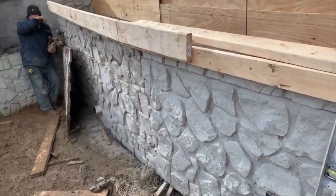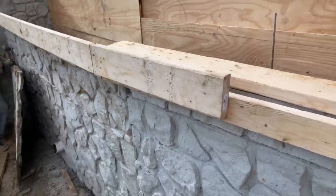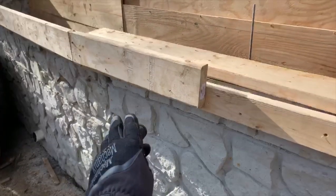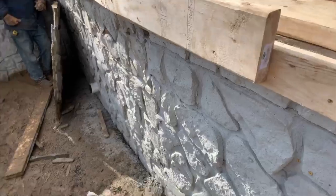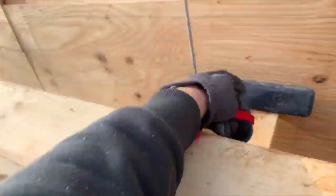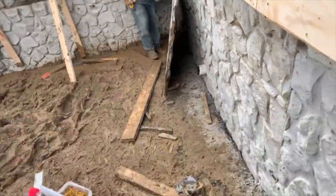And you're like, how the heck? What we do is we put a piece of plastic over on this. Plastic goes all in here. And then, of course, we put dirt up against it. So you have a weight displacement. Now, you don't have to do that. You can also put a piece of rebar in between here. Tie the rebar down, tie the rebar to the other side. And, of course, it holds it between the two, and it doesn't blow the walls out.